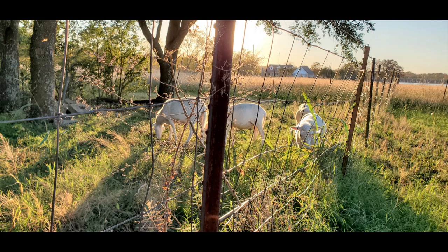It's unfortunate to have areas of excess water at times when other areas have a deficit. But then I saw a YouTube video from a homesteader out in New Zealand who uses his wastewater from his aerobic septic system to water his food forest. That's what I needed to do. So a few weeks back, I dug down and tapped into the PVC pipe that ran from our septic tank out to the sprinklers, and installed a couple of valves to divert the flow and a manifold that connected multiple irrigation lines to hoses going out to my food forest.